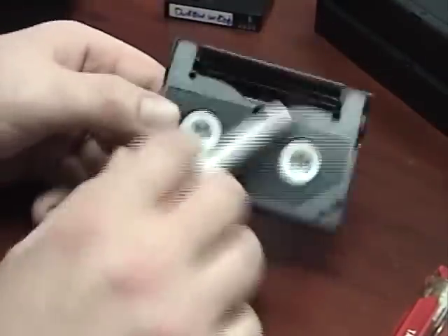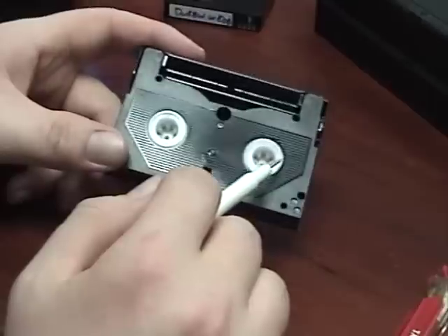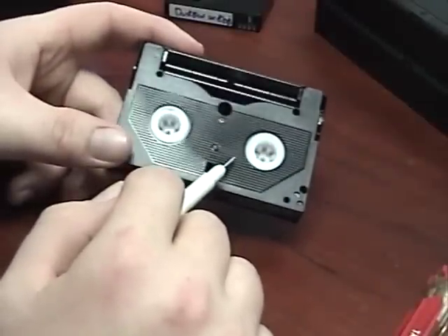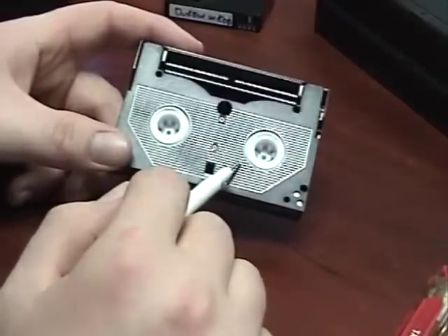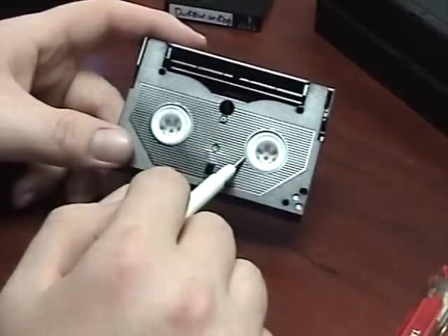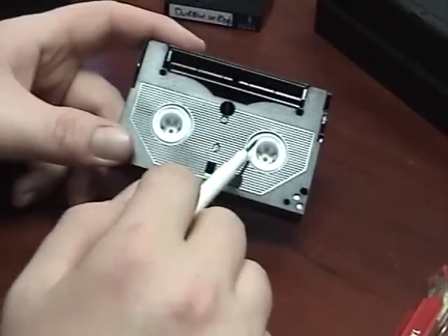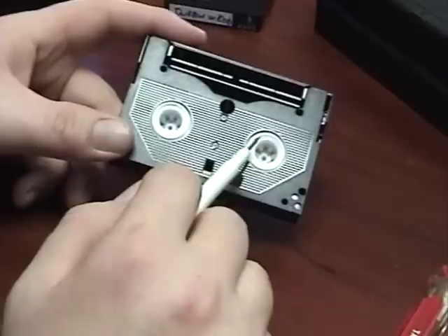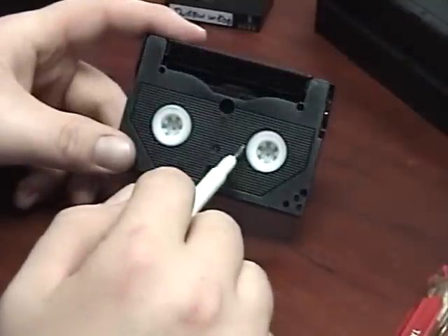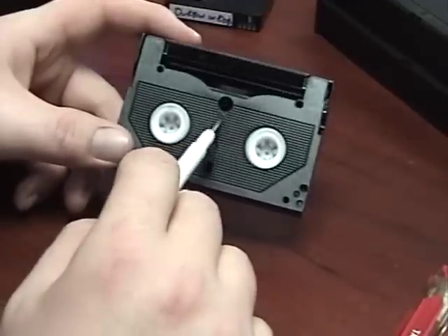Back to the tape repair process on these — all the tape repairs are the same. It usually comes off the reel or the tape's been split in two. There's really nothing else that can go wrong, other than if the tape is physically so crushed that it's in pieces, in which case you just have to take it apart. Get a brand new case. If a reel is broken, try to remove the broken parts, and if necessary wind it from one reel to the other and tape the end onto a new reel from a brand new tape. Use your judgment on how to repair those — every one of them can be different. On a tape like this, you'll need a miniature screwdriver for these little screws.